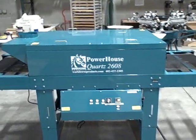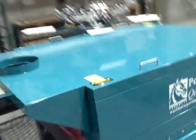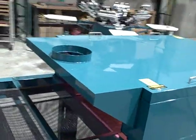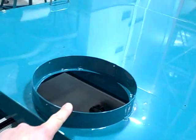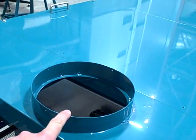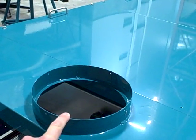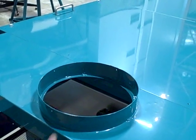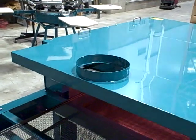If you creatively fold the shirts on the extra-wide 26-inch belt, we've heard of people running small automatics off these dryers. At the outfeed of the dryer we have a very unique venting system — we put a hood at the end of the dryer with an eight-inch hole in the center where you would mount your ductwork to exhaust out the dryer. Most people would put a small inline fan with a rheostat — available at Home Depot for under 50 dollars.